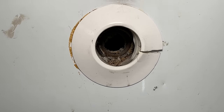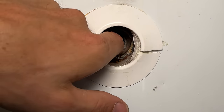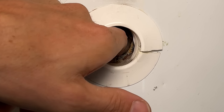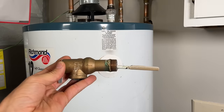You will have sediment you want to clean out — do not just push that back into the tank, or it could gum up your drain valve later on. With a Makita shop vac, I'm going to pull that sediment and debris out, and then with my finger I'll slowly work it out of the threads, doing multiple cycles — working it out, sucking it up with the shop vac, working it out a little more, back and forth until the threads are clean.